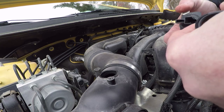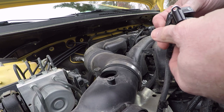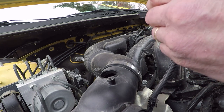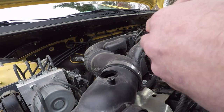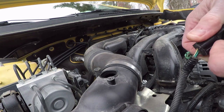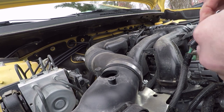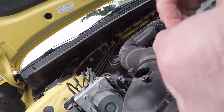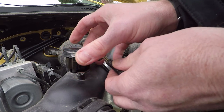Here I'm getting that echo block put on the sensor itself. It's a tight fit — you've got to be careful as you put it on that the O-ring doesn't get crimped, cut, twisted, or split. You want it in place with a nice tight seal. You can lube it up a little bit; don't use something that's going to damage the sensor. I just used water to make it a little slippier. Just be careful as you put it on. Once you get it in, make sure the bracket's lined up with the holes on the block.